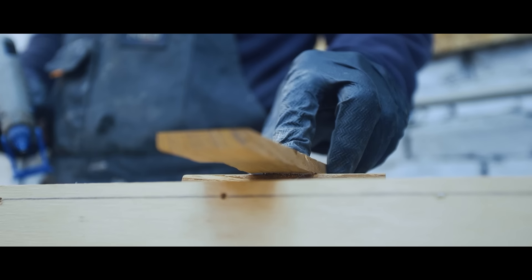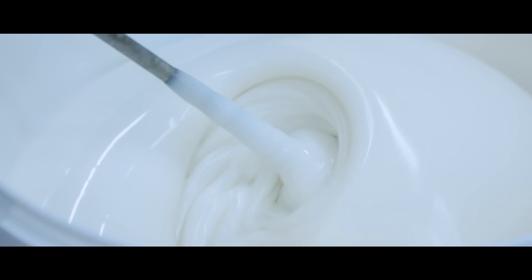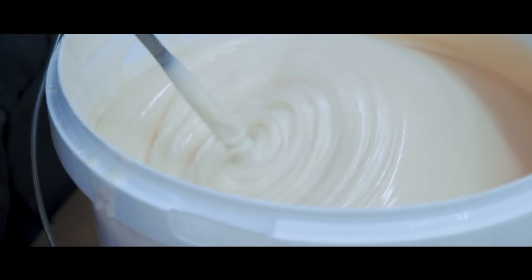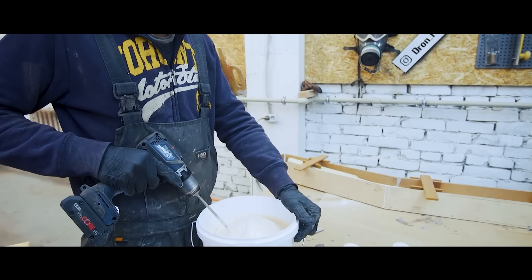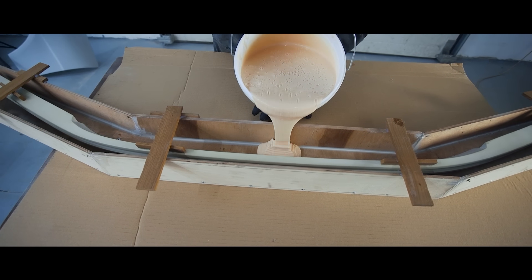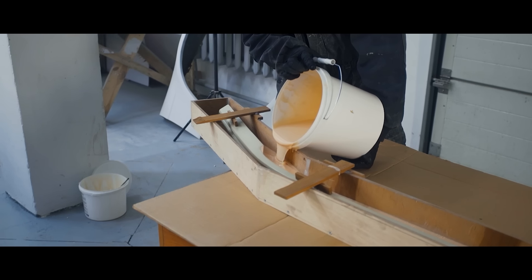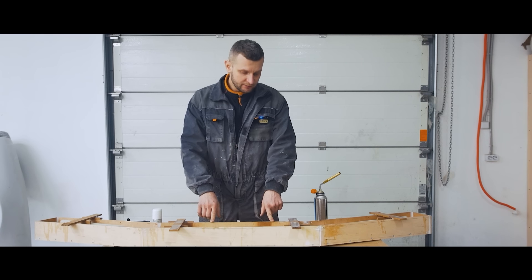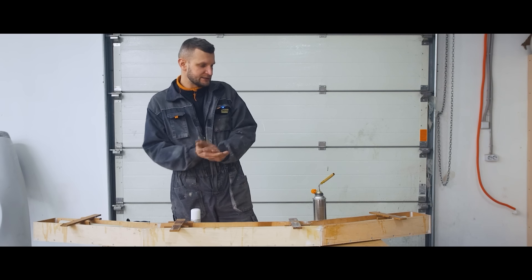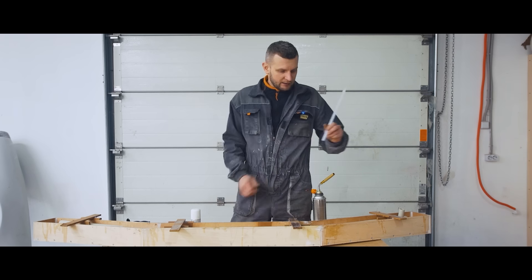Finally, we're moving to the silicone itself. This is a two-component compound designed specifically to create molds — great stuff, I would totally recommend it. I'll leave a link in the description. We decided to make the silicone matrix in two pots. The first pot is already poured in and the piece is already half submerged in silicone. Now we're gonna apply the separating wax to prevent the two halves from sticking together. We need to make funnels — we're gonna use a plastic tube through which we're gonna pour plastic. We also need outlets to let the air out, using hot melt adhesive rods. Let's get to work.